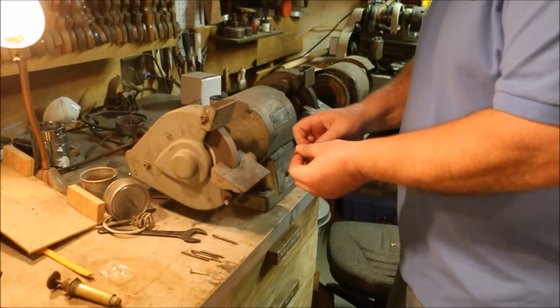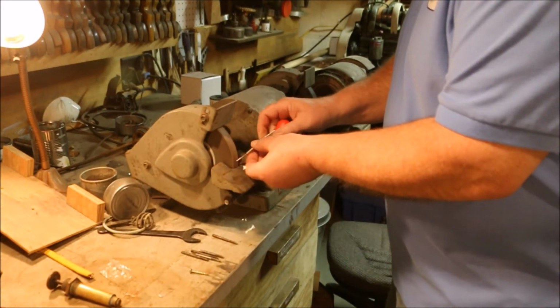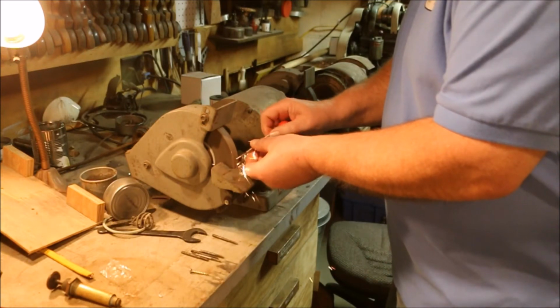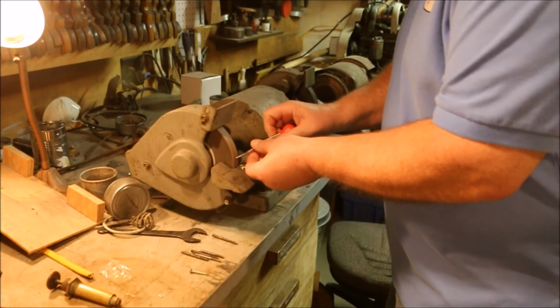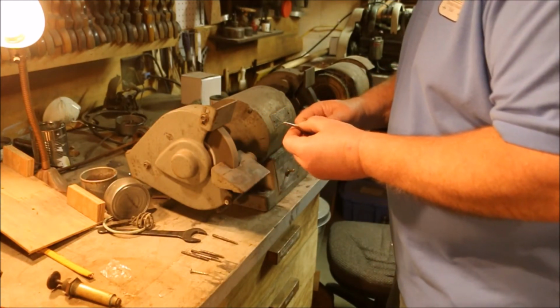Stands to reason. Well, one of the problems with trying to bolt it into the frame, there's no holes in the tubing that I'm using, so I have to put them in there. Before I can do that, I've got to put a prick punch mark on it. And when I looked at my automatic prick punch, the end had been mushed over. Time for sharpening.